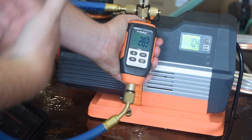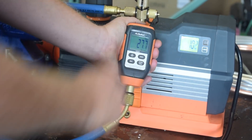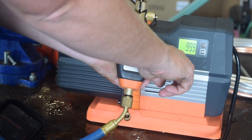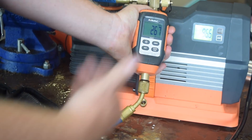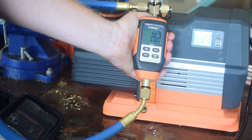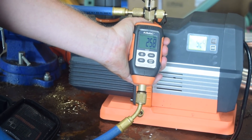If you were to do this through gauges or through Schraders, you would have a much higher differential between what you're seeing at the pump and what you're seeing at the system. That's why it's important, even when you have an onboard micron gauge, to have another gauge — but this onboard micron gauge is really a great indicator. It gives you something to test your other micron gauge against and also helps you test your vacuum pump to make sure it's doing what it's supposed to do. I'm Brian with HVAC School. Thanks for watching.